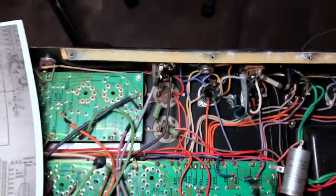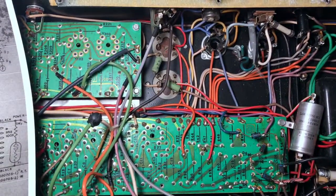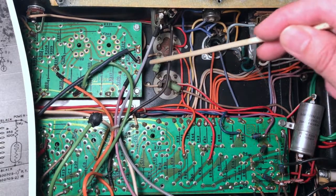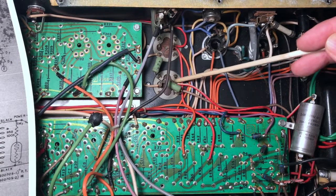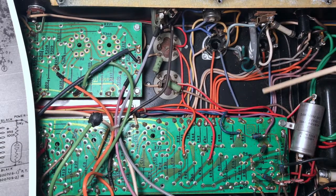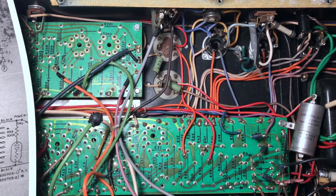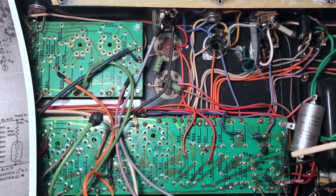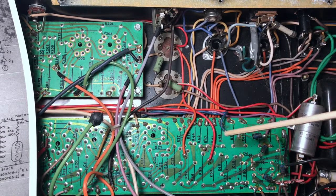Well, lift up a little bit. We know that this is the 40, and now we know that this side is actually the 40 because that's the 100 that's in series. So this 40 microfarad capacitor is connected up through here, and if you look, it is connected to this discrete component, a 40 microfarad capacitor at 450 volts. It is in series. This is the negative side. The positive side is then connected to the board here to supply the screen with a filtered voltage.